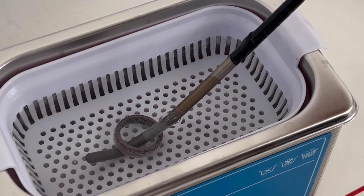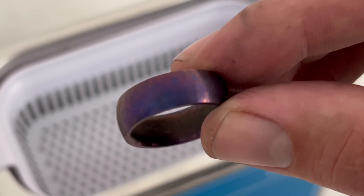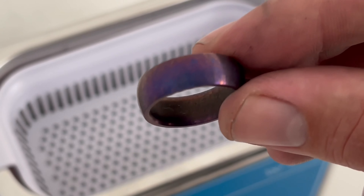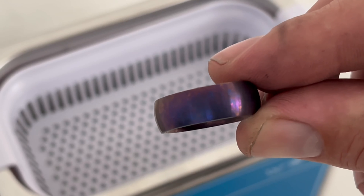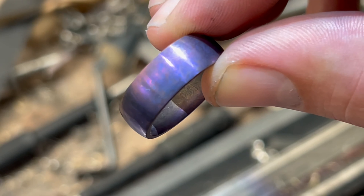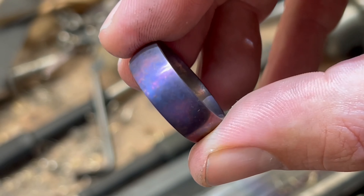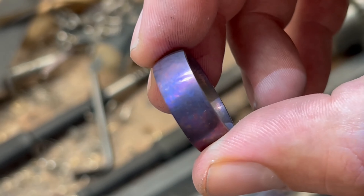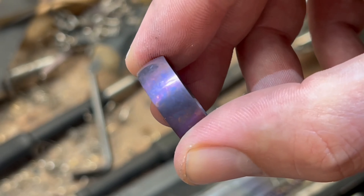Three, two, one — there we go. As you can see, we have got a pattern starting to come through. What I'm going to do now is sand that top layer off, get it to a quick mirror finish, and try to anodize that top layer to see if that actually helps. You can see the pattern there — it's still not how we want it. So I'm going to sand that top layer off, get it to a shine, and basically just anodize it without an etch and see if that makes any difference.